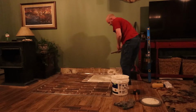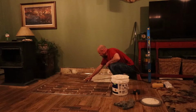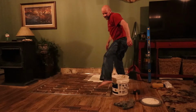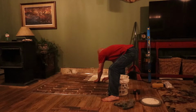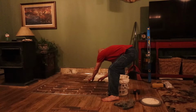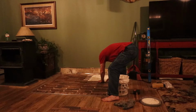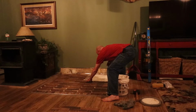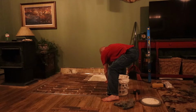If you are using true square tiles that are consistent, your grout lines are really important to get a clean looking job. And then you can use your spacers, and that way you keep your grout lines completely uniform. But with this style brick, you can't get it consistent because they're not consistently shaped. Some are longer than others, and the edges aren't completely straight.